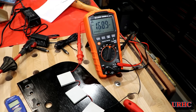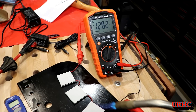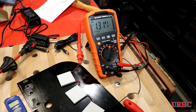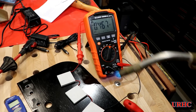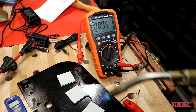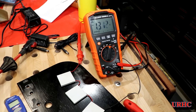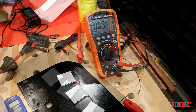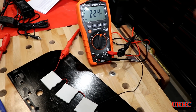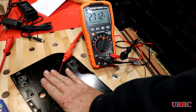That's the basic of how they generate electricity. I'm just going to touch them with a torch — not destroy them — and you can see it's up to 1.3 volts just from a second of touching with a torch. They react very fast, and they don't even have proper heat sink compound. There I get them up to about 1.6 volts. That's basically how they work, and there's a lot of information online if you want to do more research on them. That's the feature that makes them turn their little motor and spin the fan.